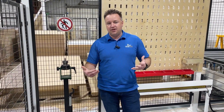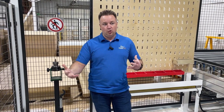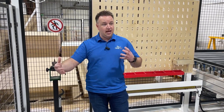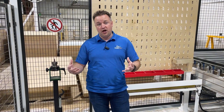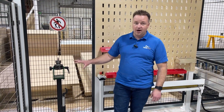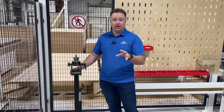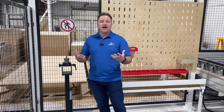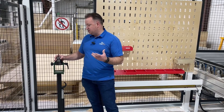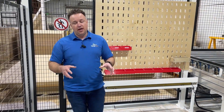We're talking saving maybe an extra 10, 15 steps. But what typically happens when we go to change a tool is it's an interruption — you're in a different area. Somebody may come up with a question about whatever's going on, and it takes a little while to get your machine back up and going. So we liked having the stand right here, right where we need it, also on a solid base. Before, we had this mounted to a cabinet and it just ended up in a bad spot. You've got to have a strong tool holder to torque this to the right setting. But now we can grab it, put it right back in the machine, come out of the safety zones, and get going again.